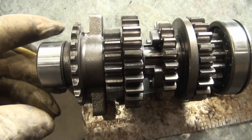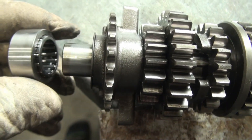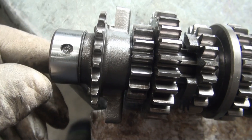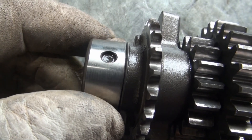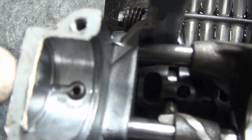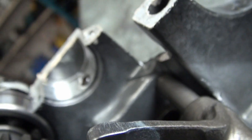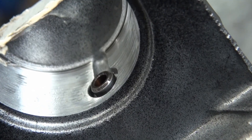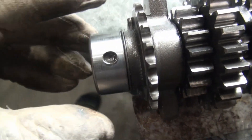There's a bearing on the end of the shaft and it looks like a thrust washer there as well. If I give it a turn, there's a partial opening — not all the way through, just a partial opening — and that is supposed to fit into a pin that looks like a hollow pin that protrudes out of the case just a little bit. That pin is supposed to keep this bearing in place.